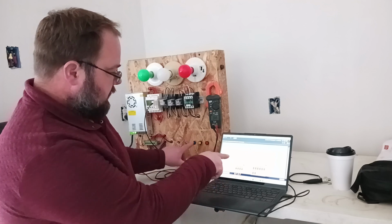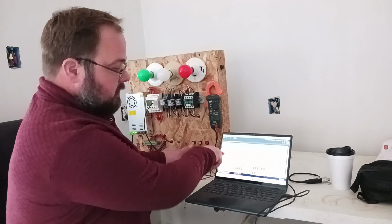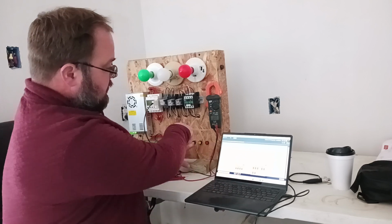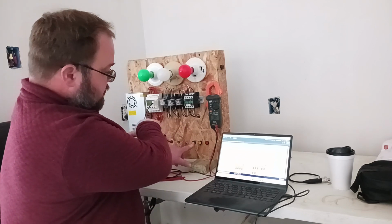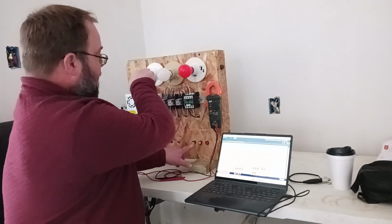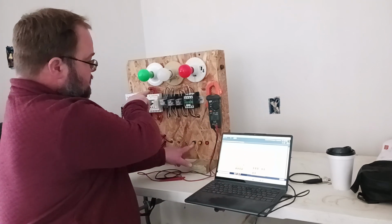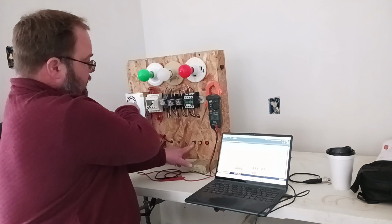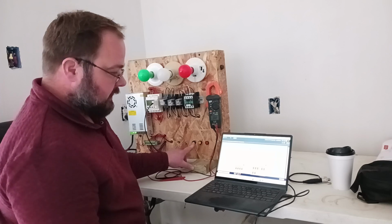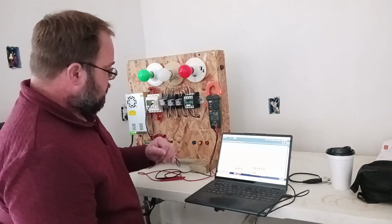So as you can see, I push my push button, and as long as I hold my push button down, my input is closed. My input is getting a signal. This says that I am getting a positive DC voltage signal. It's going through this momentary switch. I'm holding it down, and right now, as that's lit up, it is getting a 24 volt signal. So if I were to stick my meter across the negative and my input 4, I would get 24 volts. You've seen that, so you can understand that, right? So that's pretty much the inputs and how they're seen in the program.